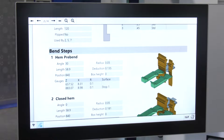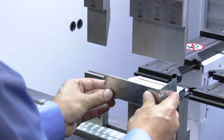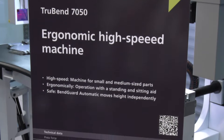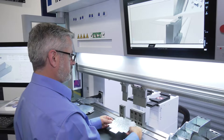You can also use TechZone Bend, so you can import a customer's DXF into the machine and it automatically generates a program for you. In terms of capacity, with the 7036 you might have been limited to thinner materials because of the tonnage generated. With this machine, you have the extra 14 tons and the extra width, making it a lot more versatile. It's electric, so it's approximately 40% cheaper to run compared to a big hydraulic brake.